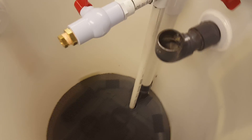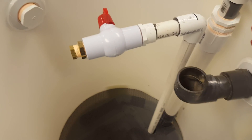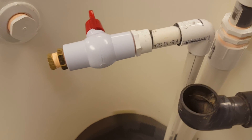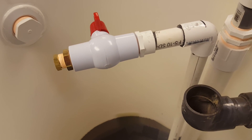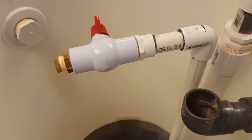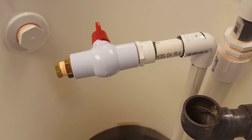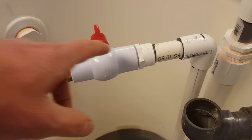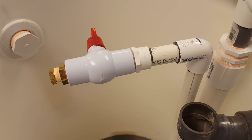Let's go back up here and I'll explain the air intakes. As I mentioned at the beginning, this brass fitting at the end is for my air intake. I will be using an air compressor to blow air into the system. You can also use a shopvac or a leaf blower — anything that's going to push enough air to clean all of the muck out of the gravel. The reason I have a ball valve on it is just so I can shut it off if the system is purged really well. It also allows me, with the threading, to unthread that ball valve and put a larger fitting on the end if I choose to do a different air system.